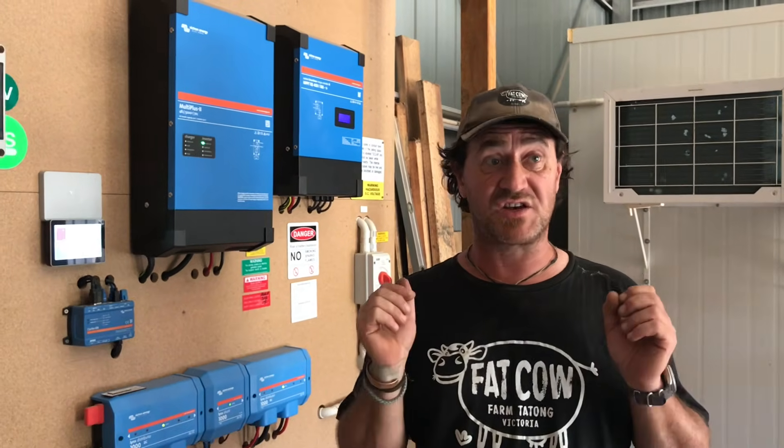I've turned on the cooler in the cool room. What we're finding from our testing is that it takes around about 15 minutes for our three by three by three cool room to cool down to the temperature set on the air conditioner, which is 16 degrees. I reckon for us, as soon as we get our CoolBot landing here in Australia — I've been waiting about five to six weeks, they're waiting for shipments from America. The CoolBot system is just going off, especially for farm environments where you want to keep your produce cool for a longer shelf life.